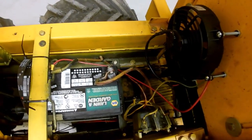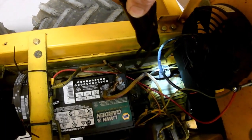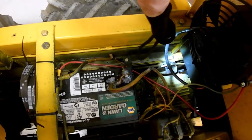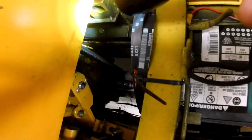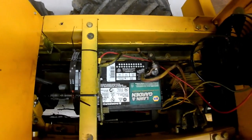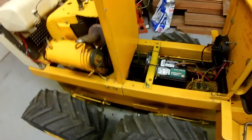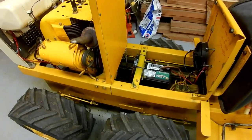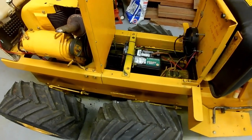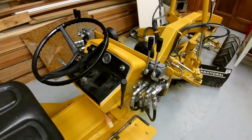If you're familiar with Cub Cadet hydrostats and hydrostatic transmissions, you'll know there is a trunnion which actuates the forward and reverse motion — it actuates the swash plate within the hydrostat. In order to sync the two axles, a connecting rod runs from the forward swash plate to the swash plate on the rear hydrostat. That connecting rod is length-adjustable, so you can jack the axles off the ground and adjust its length so that the two hydrostats operate in sync. They don't have to be perfect — if one slips, the other picks up the load.